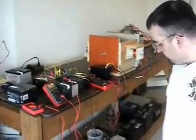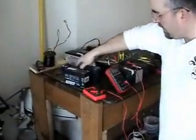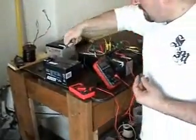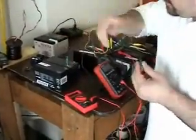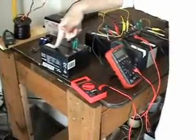I don't really know a whole lot about batteries, but I know that they hold a charge and you want to keep them up off the cement. If you take two 12-volt 7-amp hour batteries — that's what we have here — and put those batteries in what's called series by hooking the positive of one battery up to the negative of another battery, you now double the voltage of the two batteries.